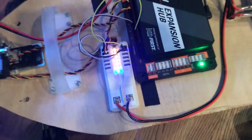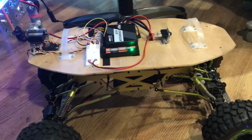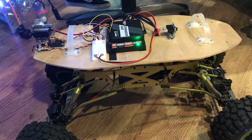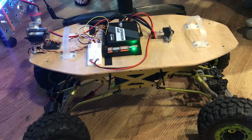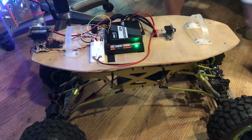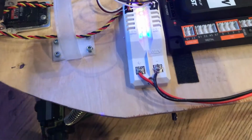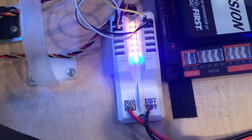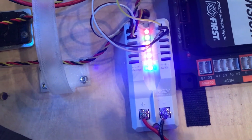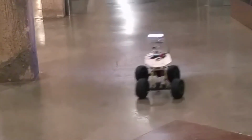As you can see here, if there is no signal, the LED flashes yellow. If the signal is roughly centered, it will be a solid yellow, and it switches to green or red if the signal indicates forward or reverse. In our front and rear steering configuration, we usually get opposing colors on our steering servos, unless we intentionally put it in drift mode, where we skew the wheels in the same direction, which gives us the ability to dodge obstacles without changing direction.